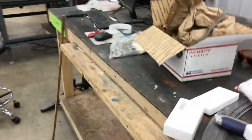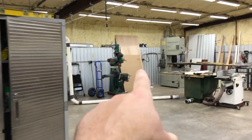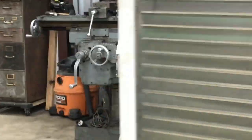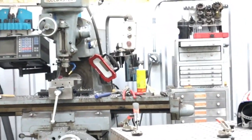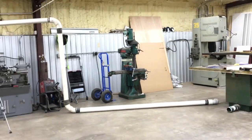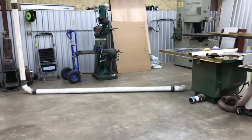I've got that order going — the parts are right here. I've cut a bunch of them out already and need to cut more for the drill and tap jobs. So this Tapmatic head is going to work out well. I can make sure my head is trammed in on both mills. I know this one is out a little bit — I've never trammed it the whole time I've had it. This one here seems pretty true but I've never checked it either. I did tram the vices in with an indicator, so the vices are square, but the head on this one is tilted a little — you can see it when you drill.